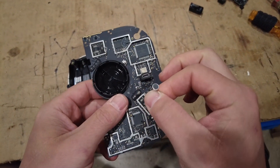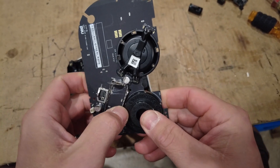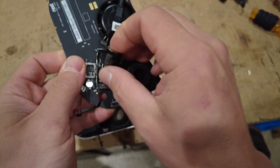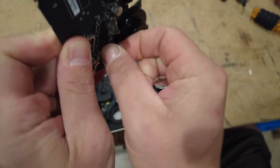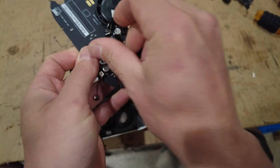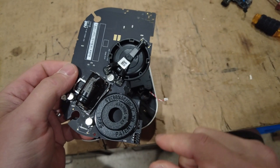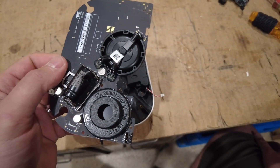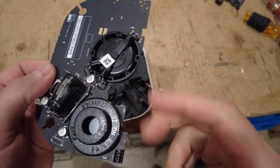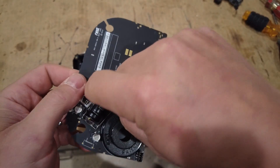It's got a microphone, and on the other side is a super loud speaker. Underneath all the shielding was the carbon monoxide sensor. It's interesting because there's a video online of somebody saying that if your CO detector is not working you should blow out that component — but that's actually the smoke detector, and you can't blow out the carbon monoxide sensor.